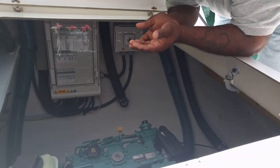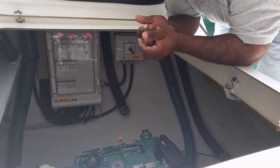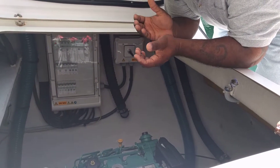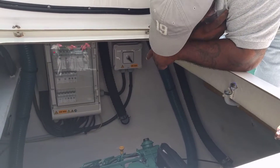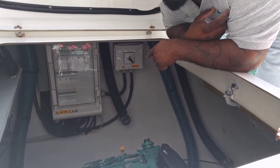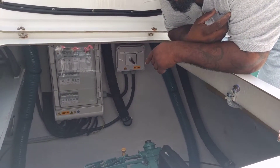So basically, in the air conditioning, it plugs in. If something's not working — that's in the air conditioning, not working in your room or anything — check the switch right here. Whichever switch is down, put it back on. Up is energized; down means it's been tripped.